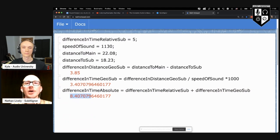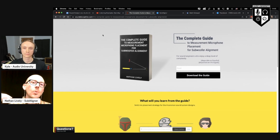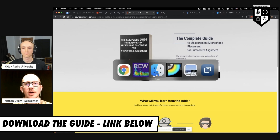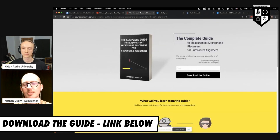The value of Subaligner is not that it's doing these calculations for you — it's that it has 47,000 processing presets that you might not already have. Loudspeaker manufacturers will sometimes give you a table with all of their alignment presets, but they're not going to tell you the alignment between their brand and another brand. That would be thousands of pages long. That's what Subaligner does. If you're going to use the relative absolute method or Subaligner, you still need to decide where to put the alignment position. This guide walks you through four of the most common system designs that create subwoofer alignment problems and talks about where to place the mic or stand and listen. It's also available in Spanish and Portuguese.